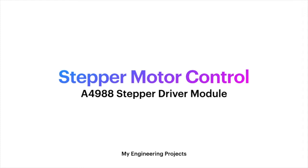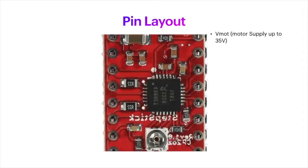All right, let's go over how we're going to connect the A4988 stepper driver module. The first thing we're going to do is look at the pin layout. The way I have this organized is I have the screw here at the bottom, which is an adjustment screw that regulates how much current can be output from the driver. And we're going to start in the upper right hand corner.